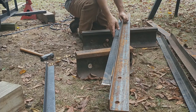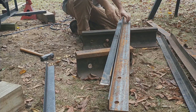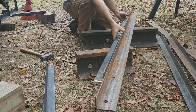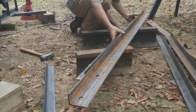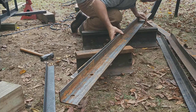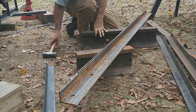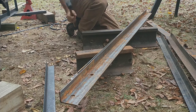And if I flip it over, this side is actually fairly straight. Although it does this number down the length of it. See, there's the top rail. Both of them are 2-inch. And let me do it for you down there. All right, so you see the difference between the two rails, the height of the two rails. That's with it perfectly straight to where the bend is. And at that end of it, I'm going to call that 3/4 inch. Now, this 3/16 is a whole lot harder to move. So, I have a 4-pound sledgehammer. Now, this might be a 3-pound. I wonder what I can get that's bigger.